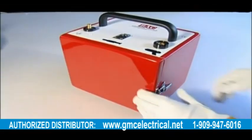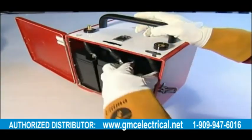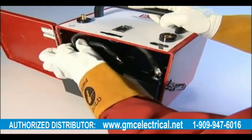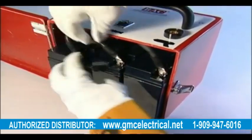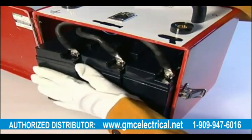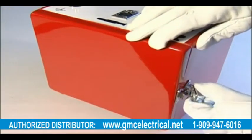A standard pin brazing unit comprises three 12-volt batteries wired in series, creating a 36-volt operating system. Standard batteries are a wet-sealed non-spill type and require no maintenance other than regular charging and visual inspection to ensure there are no loose cables, visible damage, swelling or leaks.